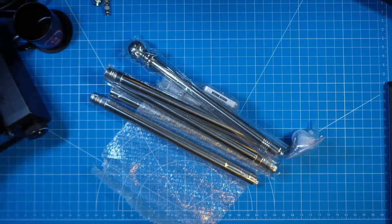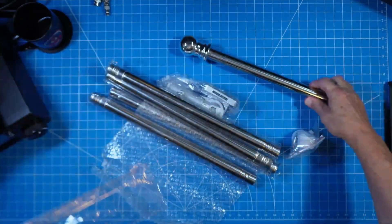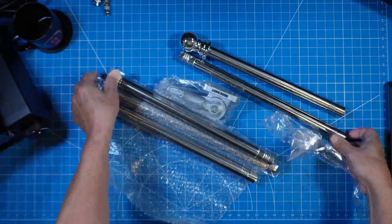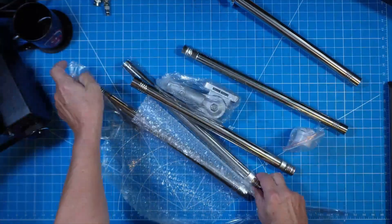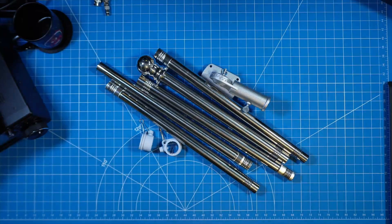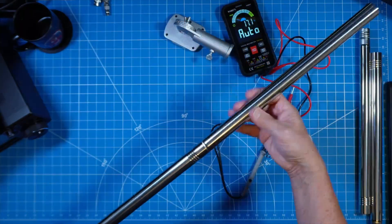I can hear those fingertips clicking away on the keyboards in the comment section — Bob, this is a compromised antenna, I'll grant you that. It's unconventional for sure. But for those who can finally put up a flagpole permanently where they live that doubles as an antenna, this is golden. I'll leave a link in the description where you can pick up this flagpole from Amazon. It doesn't matter whether it's this one or another of your liking — just get something that has continuity. Don't go for something that's painted, otherwise you'll have to scuff the surface to get conductivity from section to section.